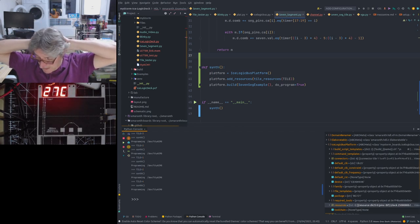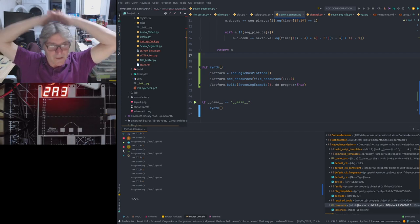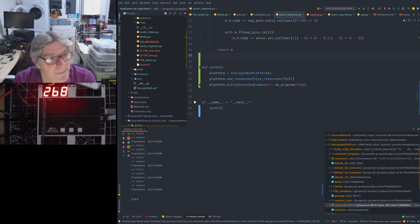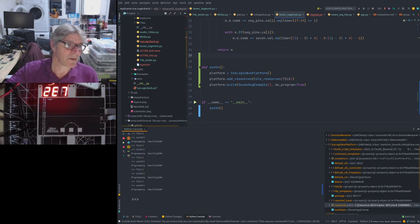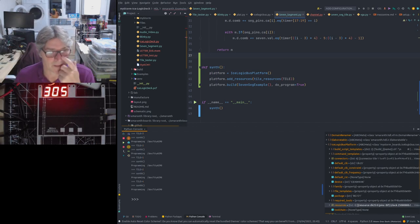What else is on the mezzanine? I'm trying to remember. I know the USB works. I need to do at least some basic power delivery testing. I haven't done any of that yet on this new board for the second USB. One of the other things that I want to do for the final versions: currently the power delivery is on the BlackIce NXT mezzanine board, and I want to take that off and put that down on the Ice Logic bus, because that's really where it should be. It's in the wrong place.